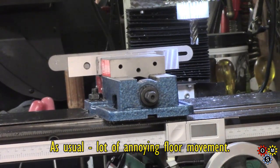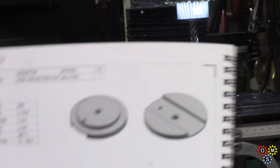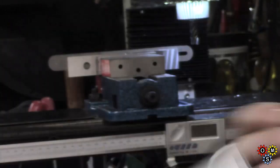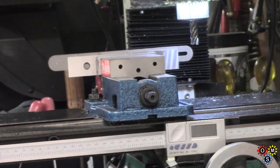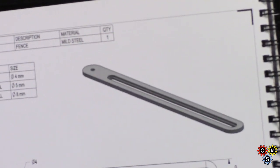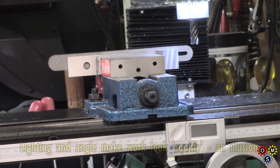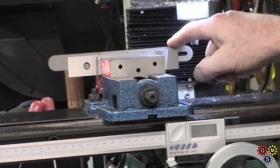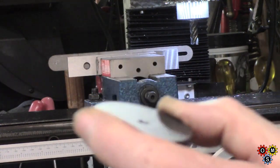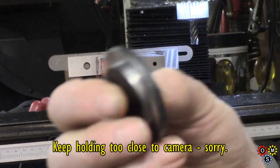I'm concentrating on the parallelogram and I've got some milling to do. This piece here — we've done the register on it and we've got to mill the backside for this piece. That is referred to as the fence. That's all part of the setup for cutting tool sharpening, not milling cutters. The pieces are laser cut, and the edges are pretty darn good.